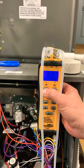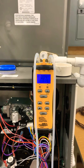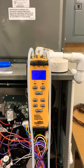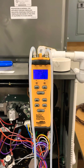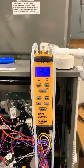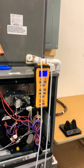Now I'm going to change my port to port 2 where we're measuring return static, and I'm going to block off the return grill. Watch what it does to the static pressure. It's well over an inch of static, which is extremely, extremely resistant. Basically what I'm demonstrating is a dirty filter or a blocked coil. These things will contribute to the resistance of the duct system and will reduce your airflow.